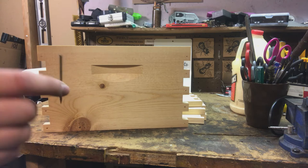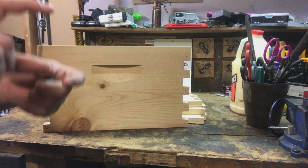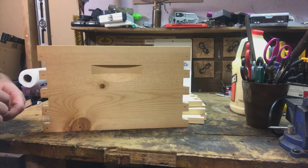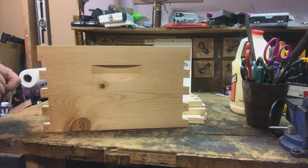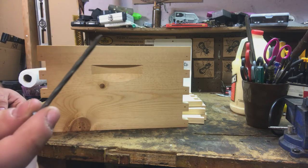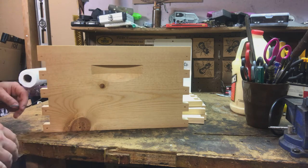So what do we fasten a hive with? A lot of the time the hive will come with nails, and it came with these nice outdoor ones, but these really don't have great teeth. They are a good depth for a nail, but I've often pulled those out after enough time of movement, bowing, and even a little bit of rot. They just don't hold well. I would recommend just don't use nails at all. But if you are going to insist on a nail, use one of these spiral nails — they do an amazing job to where you'll never pull that joint out again.